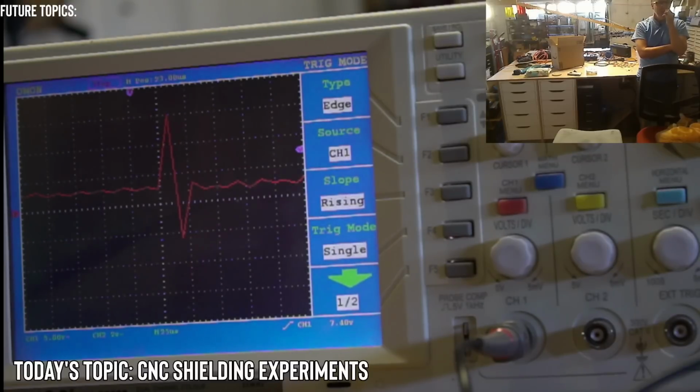Yeah. So that's a 40 kilohertz signal. Okay. So what would calm a 40 kilohertz signal? What capacitor would do that? Z equals 1 over JWC. Yeah, I'm not doing that math right now. We could, I guess, later on. I'd have to know what that formula is first, though. Okay, so it depends on the resistance and inductance in the lines, right? Okay, so W equals 2 pi F. Okay, so 0.1 UF would shunt a 40K to ground, no problem. 40 kilohertz or 40K resistance? I mean, I could try a 0.1 UF across the, like we did last time, across the probe and earth.